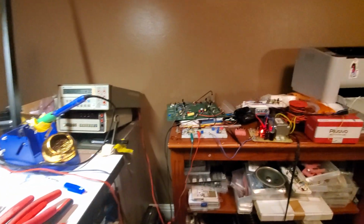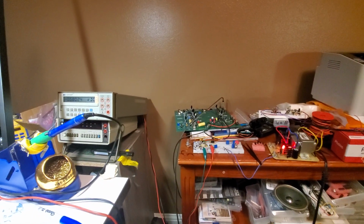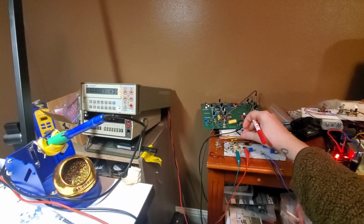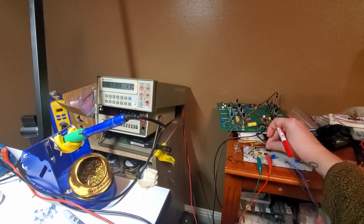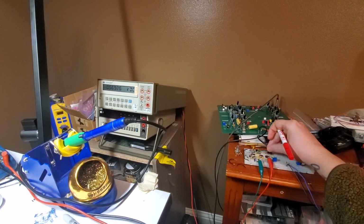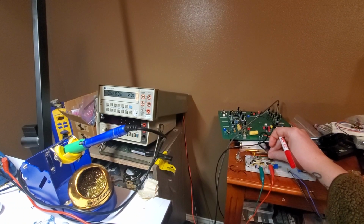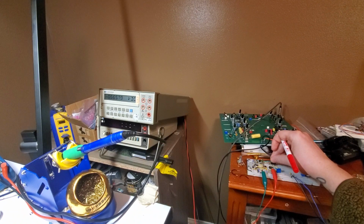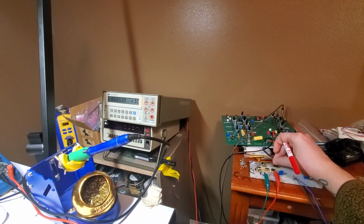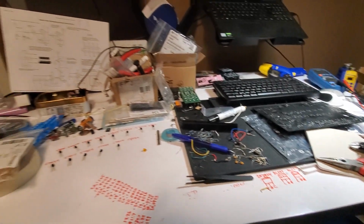Okay, so yeah, I wanted to show how much of a difference this makes. So I can't show both on camera. Maybe I can, since I've recorded now. But let's go over and touch this. Let's get this baby warm. Yeah, look at that go. Totally, it's dropping. So we're putting a constant current through here, and we're measuring the voltage drop between base and emitter. And yeah, 565 millivolts when it was 580. So yeah, big difference. Cool.